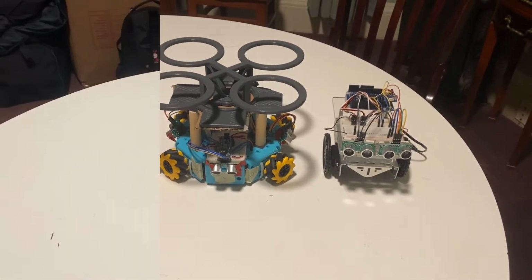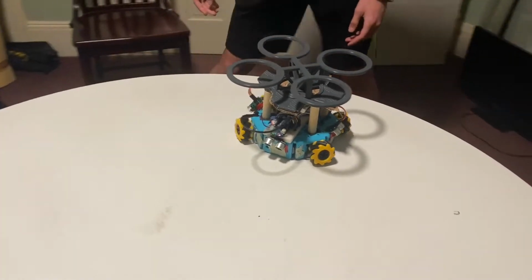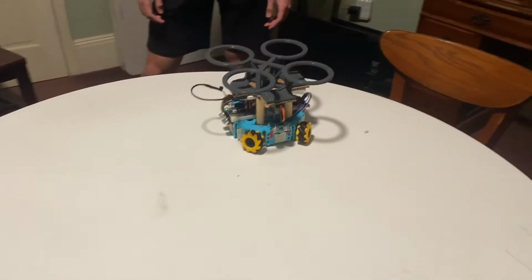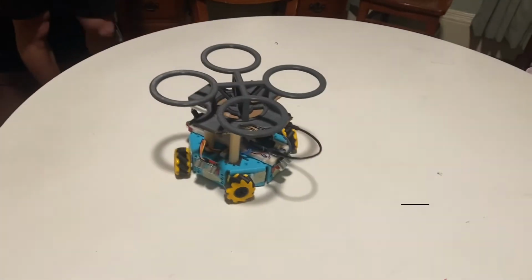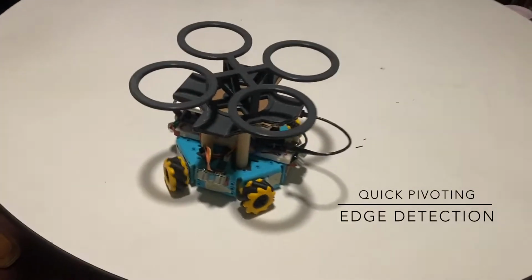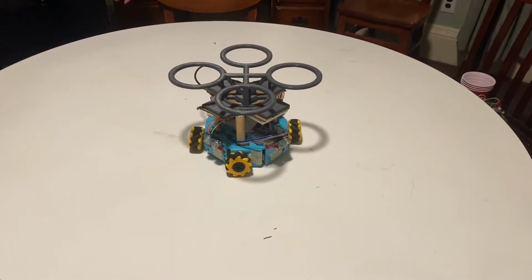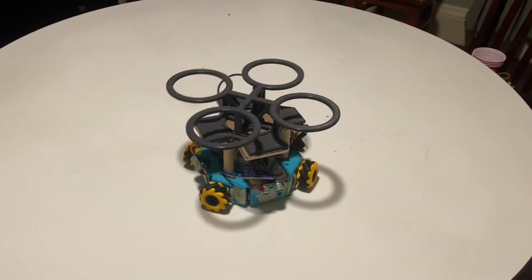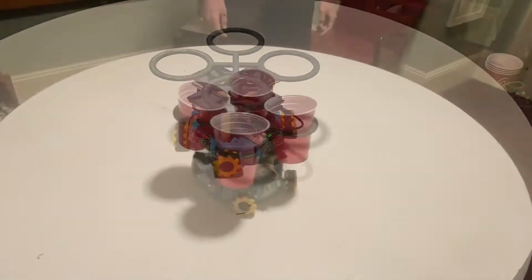This required two main upgrades from the Bobot we are familiar with: omnidirectional movement, in which turns could be implemented instantaneously and without the bot having to stop to rotate the chassis, and second, to detect edges, we utilized four distance sensors, which would have to detect spikes in distance readings and act to move the robot away from these detected edges before resuming random motion.